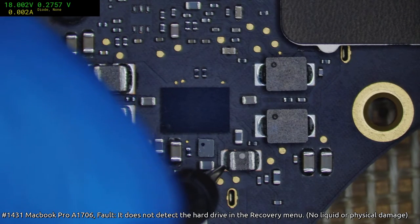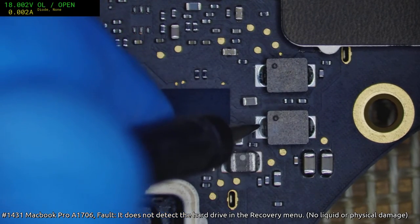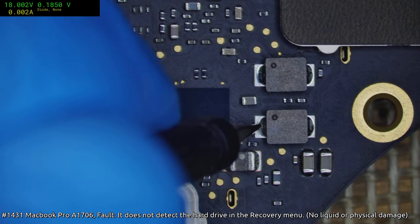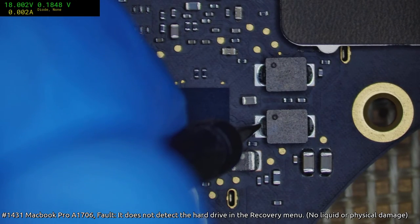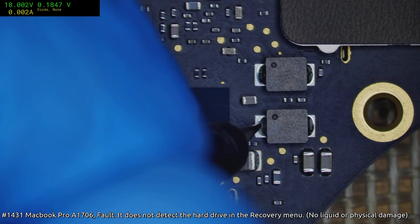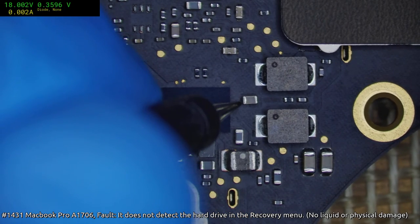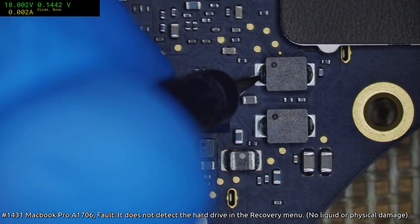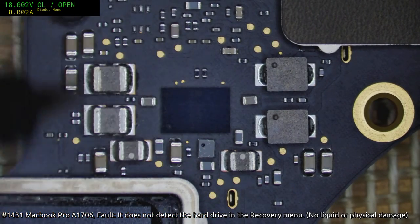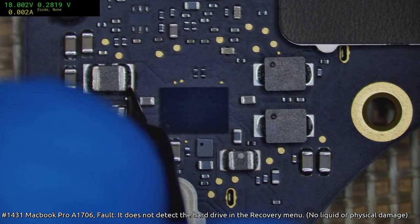2729, that's good. 3435, that's good. 228. Yeah, that's a little on the low side. That's 0.9 volt. Now, according to diode mode, that should be 228, but yeah, well, 0.8. Yeah, it's okay. It's not as bad as I thought. I was thinking it was something else. Yeah, that's okay. 228. It could be maybe this is just a different configuration. These should be all about the same.